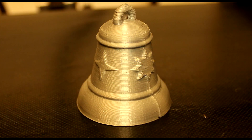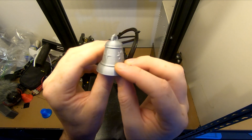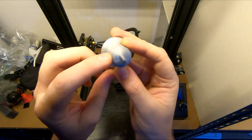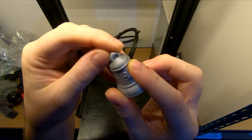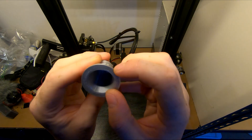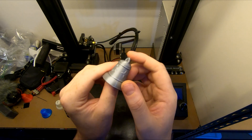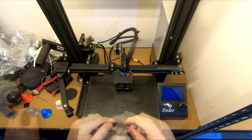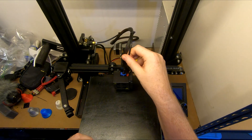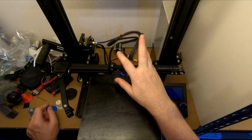We also moved across to something we've always had issues with — silk PLA. I don't know if many of you have printed with this, but I've always noticed that when it retracts, it sort of expands the filament, which is quite weird. It printed out pretty good. The only issue we started having was further up around the handle where it started to extrude not quite as nicely — possibly because there are so many retractions in a small area. But overall it's still come out great with minimum setup, basically running the default profile. We'll put the link for the tubing in the description as well — it's got a lot tighter tolerances than your stock tubing, which helps with TPU since you've got to print it quite slow. It shows you can still print on this style setup without having to go straight to direct drive.